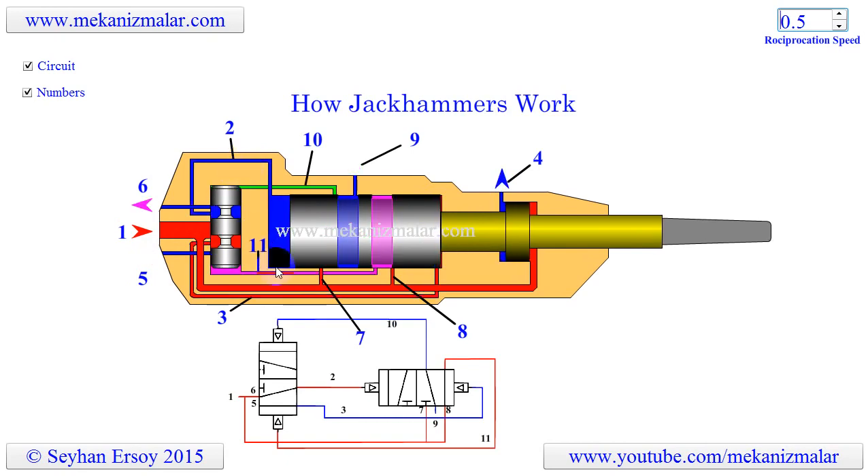In this case, the bottom of the piston is pressurized through pipe three, and air at the top of the piston is sent to the atmosphere by pipe two. During this process, air bleeds out from the shock absorber chamber at point four. The purple arrows at points five and six show the discharge of the pressurized exhaust air alternately.